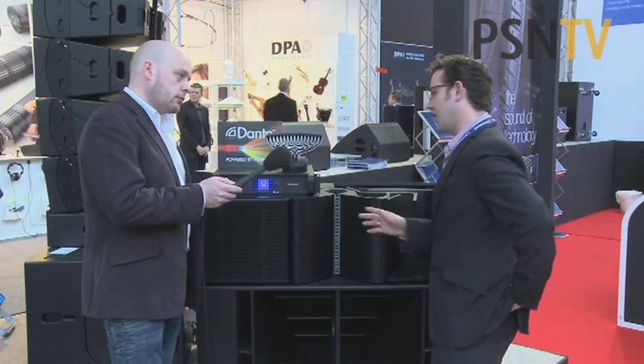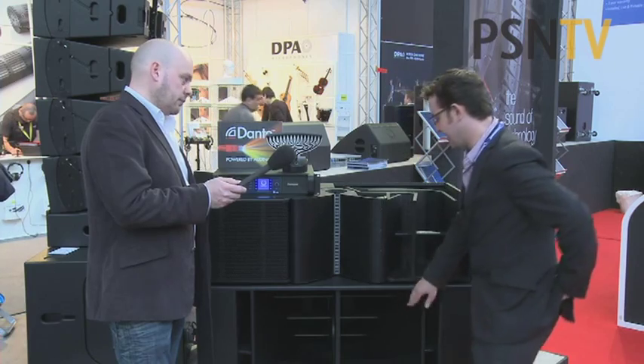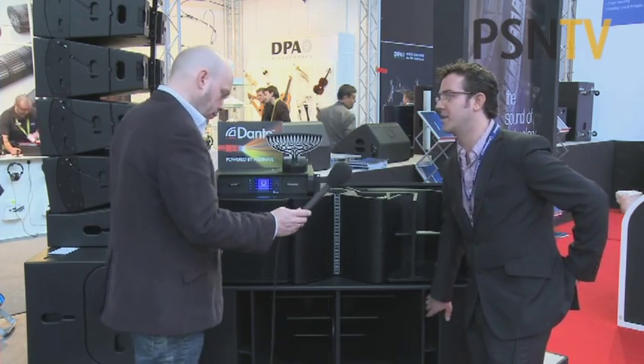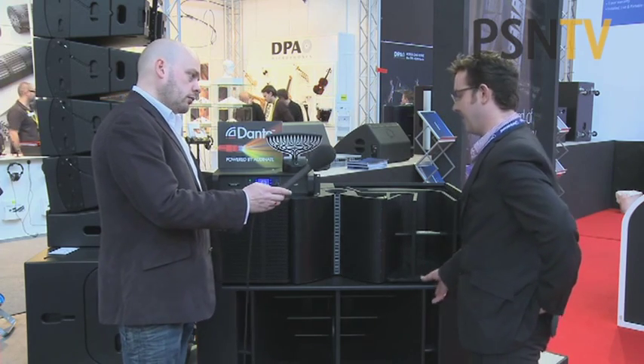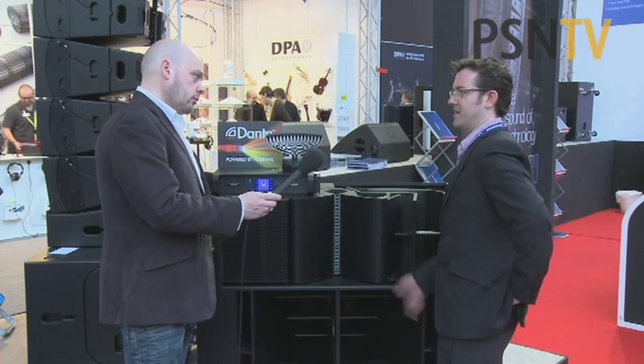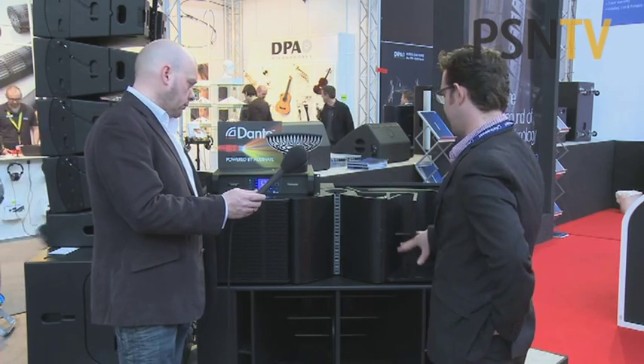In the case of the sub, it's a new kind of loading for TurboSound. It's a dual 18-inch, 1,500-watt RMS per driver, so a 3,000-watt RMS box, 6,000-watt continuous peak. The major difference for us is that we've ported the rear volume of the driver. That's a new thing for TurboSound, and what that means is one box will do the bottom octave — it's about minus 3 dB at 33 Hz, so it's a real festival sub.